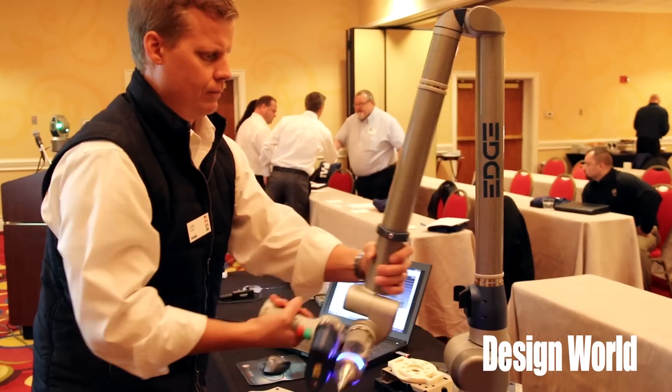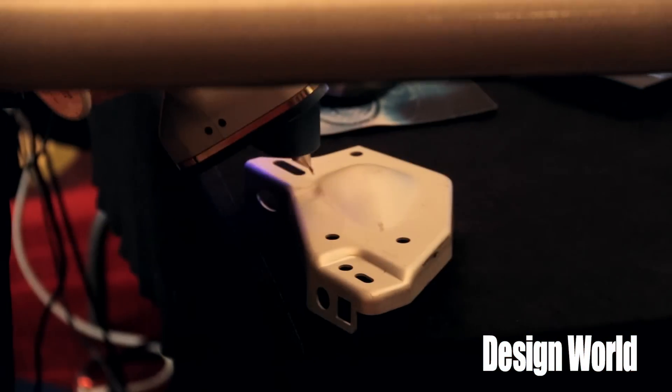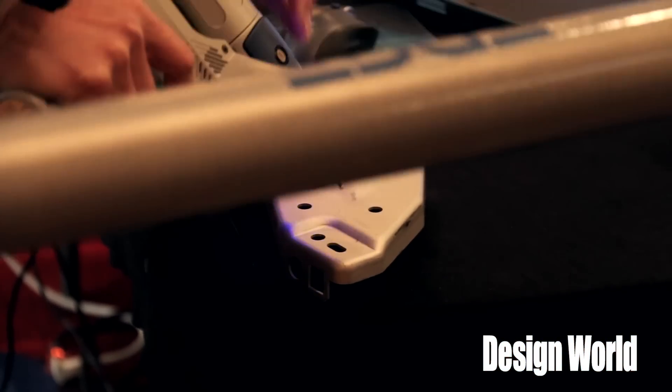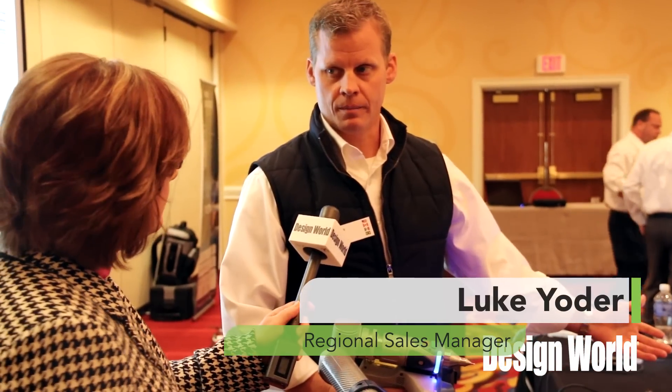The affordability of our products gives us the opportunity to come right out to where parts are being manufactured. The Faro scan arm gives us the opportunity to do probing activities, so if I want to probe prismatic features like planes, circles, cylinders, or surface points, and then the laser scanner mounted on the bottom gives me the opportunity to do non-contact laser scanning, which is highly beneficial for free-form surfaces.